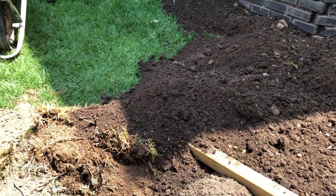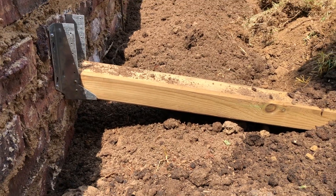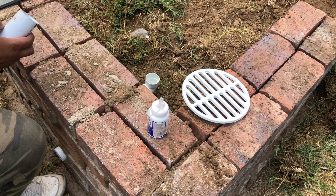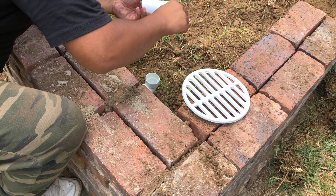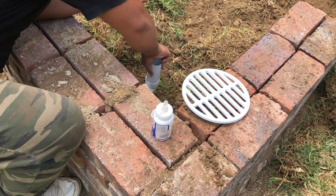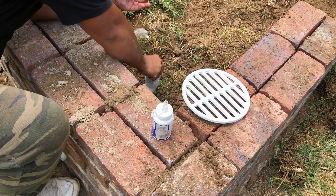We're finally covering the dead man. If you don't know what the dead man is, go and check out part one where we explain exactly what the purpose of that structure is. You can see the angle, and of course all of that earth will be sitting on top of it to help increase the strength of the retaining wall. In addition to the channel drain we installed earlier, we're going to be installing gully drains here in the corners where the steps will be, because the retaining wall is creating almost a blockade for water, so we need to get the water out.